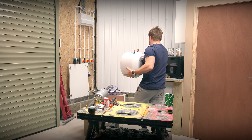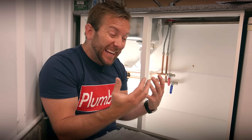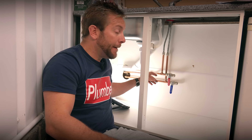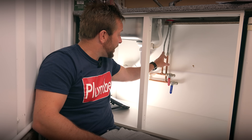Now let's have a look under the sink where we're actually going to be installing this. A water heater doesn't weigh a lot when it's empty, but when it's full of water it can weigh quite a few kilos — I'd normally try to mount it on the side bit of wood because it's usually a lot thicker. I've already first-fixed our pipes: we've got our cold main coming in here, and then we've got our hot going back out. The hot pipe is feeding up to the tap here and also running round to the small toilet next door.